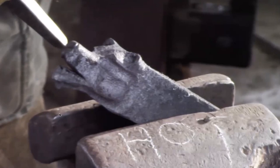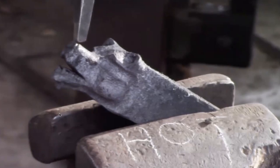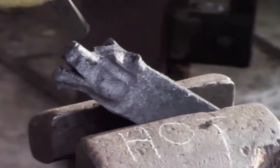Again, it's important to me that this side set have soft edges so that you can link the blows together. You're not creating chatter marks, but the bottom edge, the edge that's resting on the actual nose now, is reasonably sharp. And I'm just trying to push the snout away from what will be the nose. Let's have a look at another view of the same thing.